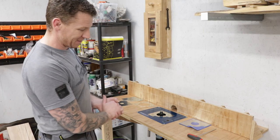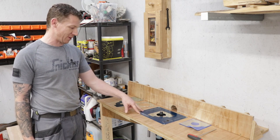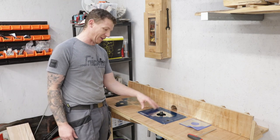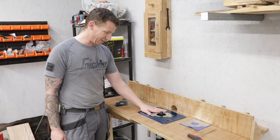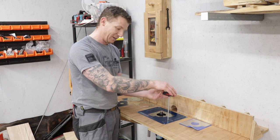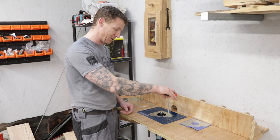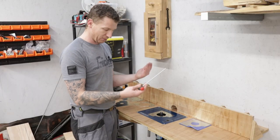One fully upgraded router table. It's turning into a bit more of a premium router table, but still a nice cost-effective way to build yourself one. My first impressions are very, very good — it's a premium product and it feels like it. The engineering is flawless as far as I can see, the tolerances seem absolutely excellent, and the adjustment is very fluid. Each one of these marks is almost equal to one millimeter per turn, so you can be very precise. The lock underneath just tightens down to lock the mechanism so the screw can't go up or down, meaning vibration won't cause it to change height.